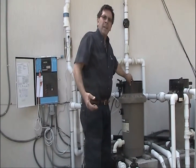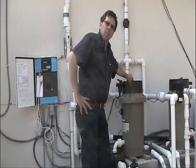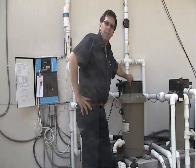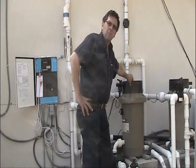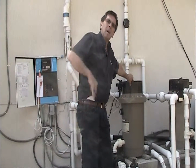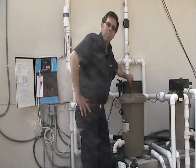And what we're doing now is we're recirculating the water back into the pump and getting all the air out of the system. The next thing that we do is immediately put in the proper amount of diatomaceous earth. On an EC65 it's 6 pounds, on an EC75 it's 7 pounds. EC40, which is more of an above ground pool system, you're looking at 4 pounds. So again, immediately go to the pool skimmer and actually add the proper amount of diatomaceous earth.